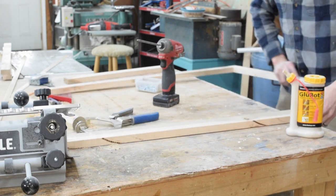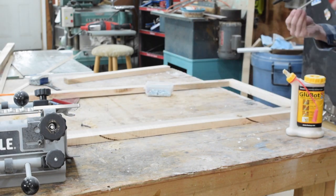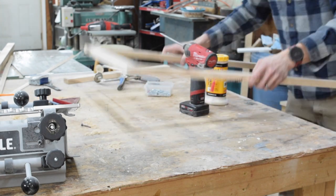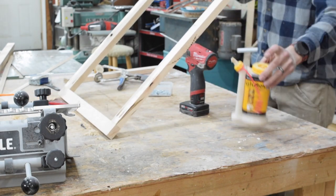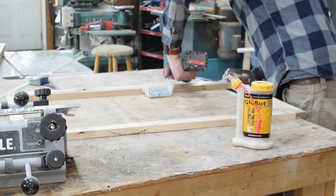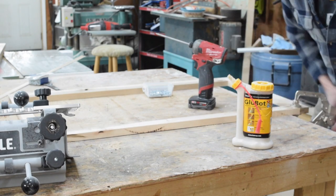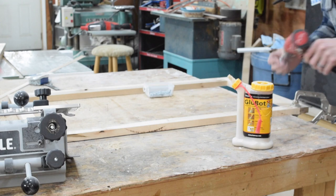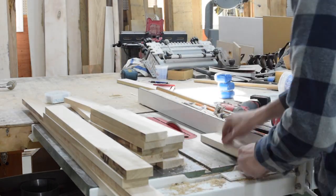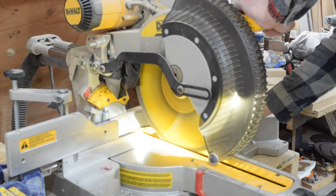To some extent I feel like I'm in a weird position between the traditional face frame style cabinets and the new more European style frameless cabinets, where I kind of bounce back between each as I see fit for each different project. This is a face frame project because it will have openings that I want to show as square, and the face frames also help me set and scribe pieces to place.